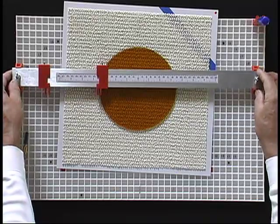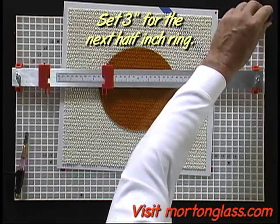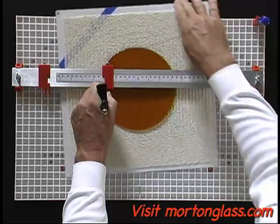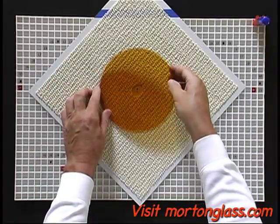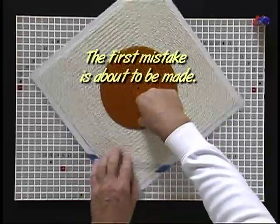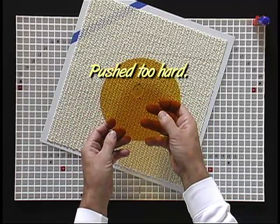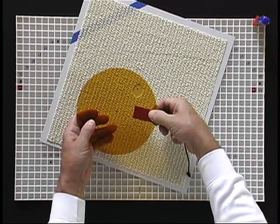To shorten the video, I will skip showing the 7-inch ring. Problems on the 6-inch ring will be more interesting. Use the dot to center the glass and adjust the cutter guide for a 6-inch circle. To set the size of the circle, we always use the radius, which will be 3 inches. In running the score, I will make a foolish mistake. By forcing the run and pushing much harder than is needed, I will cause a break in the half-inch ring. Take some time to evaluate the problem — sometimes you get lucky. I have decided that the runner from the safety brake system is the perfect tool to help me clean up this mess. A few pushes in the right places and the ring is ready to be removed from the circle.